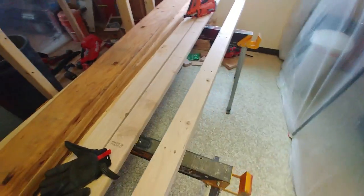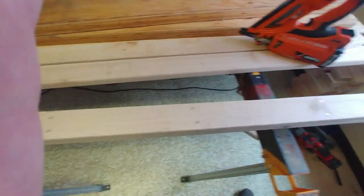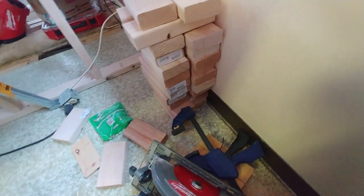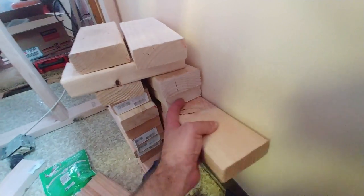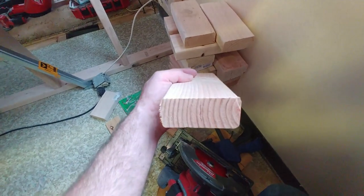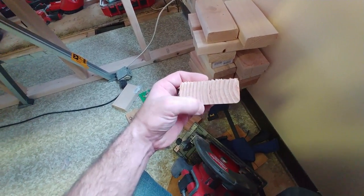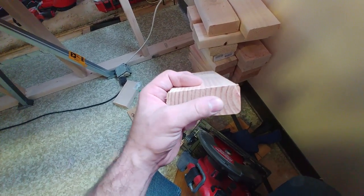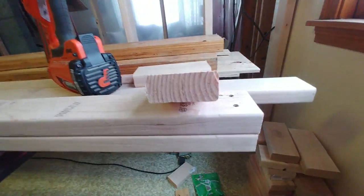Now, normally, when we're talking about lumber, it's nice to have quarter sawn, which would mean, well, let's just demonstrate. These are all the little ends I left cut off of pieces that I've been cutting around here. And let's find a nice example. Here's a nice example of quarter sawn. In hardwood and furniture building or fine woodworking, we like our wood to be quarter sawn, which puts the grain almost straight up and down. This is softwood and it's cracked up, and the grain is very wide because this was grown quickly. But this is an example of quarter sawn.